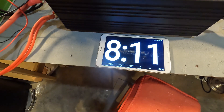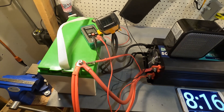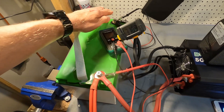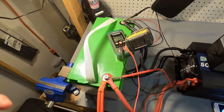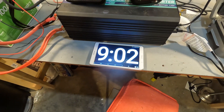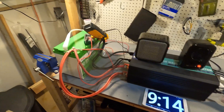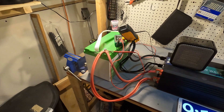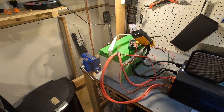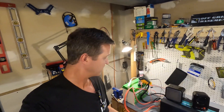We've been running for about eight minutes. The terminals are starting to get pretty warm with 310 amps going through them. The battery is now at 11.59 volts and we're at nine minutes. Unfortunately I'm going to stop this test — I don't feel like this battery has any kind of over-amperage protection. Maybe it has over-temperature protection, but I don't want to test that. The over-amperage protection, in my view, is a fail.